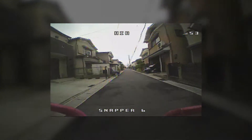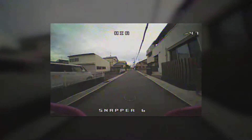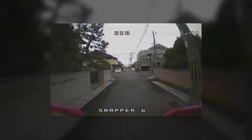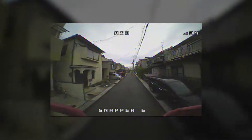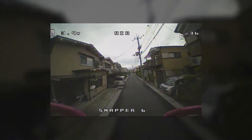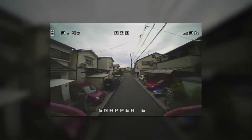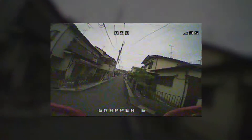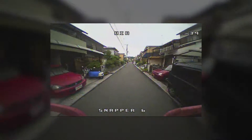So first I'm gonna use the linear antennas that come with the goggles, flying in a straight line to see how they perform. A lot of people dismiss the linear antennas, but we'll see. Here I am at about the 100-meter mark and the signal is pretty good — I have a few breakups here and there but the video is still pretty clear. I can fly with absolutely no problem; they perform very, very well actually. I reached the end of the street — these are 200 meters from where I am — and coming back I have pretty much no breakups whatsoever.